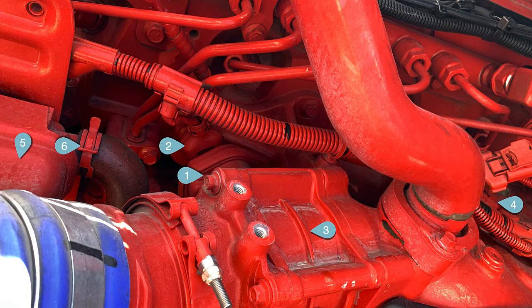This slide shows the throttle valve on the front. The blue hose is a charge air pipe on the driver's side front. Number one is the motor that drives the throttle plate; number three is where the butterfly is down inside the housing; number two is the connector on the back of the motor. Number five is the drip housing for the crankcase breather, and number six is the vent off the drip housing that goes down to the ground — virtually no oil comes out of it. Those two steel lines are the fuel lines supplying rail pressure. The fuel pump now has two completely separate pumping chambers, so if one fails, the pump will still make pressure on the other and you're not stuck on the side of the road.